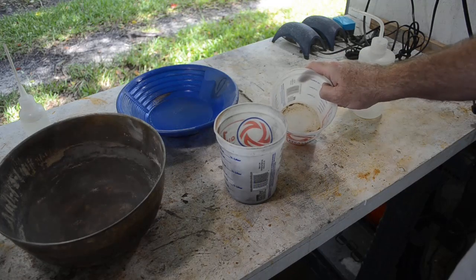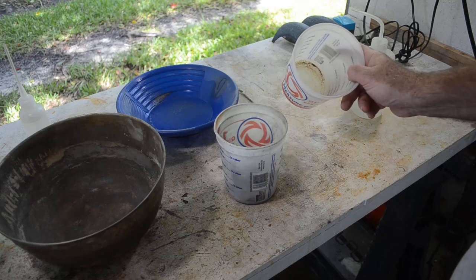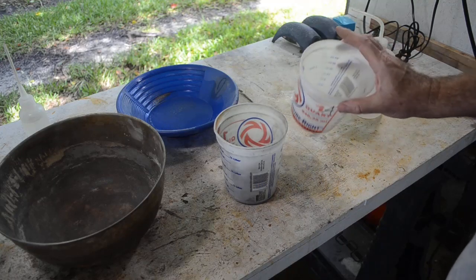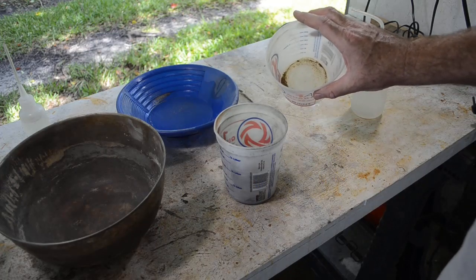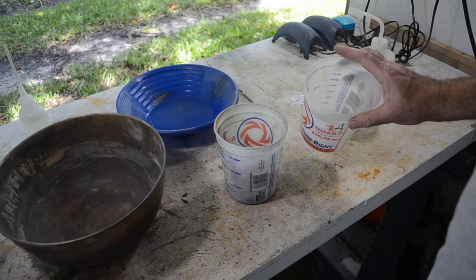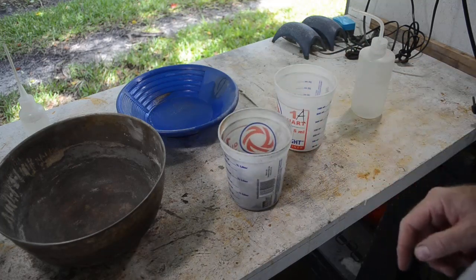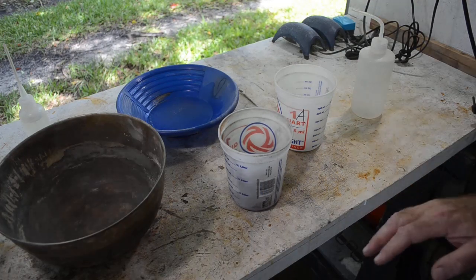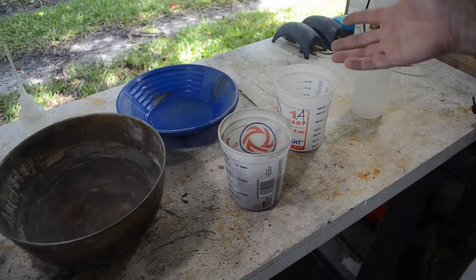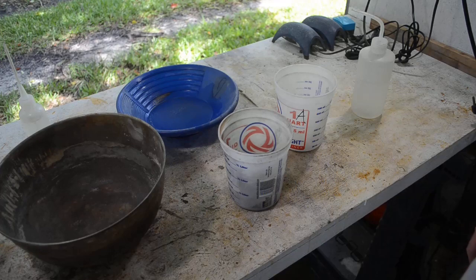We'll probably roast the sulfides before doing a smelt. Now, these sample A sulfides have been sitting around a while and they look like they are oxidizing on their own. Looks like they're turning into rust. But I'll probably roast them anyway just to make sure they completely get oxidized. And the same with these, we'll roast them and then we'll smelt them and see if we can get any gold out of them. So in the next video, by then I should have sample B all crushed and panned out, the rest of sample A panned out, and we should be ready to do some experimental smelting. So stay tuned for that.